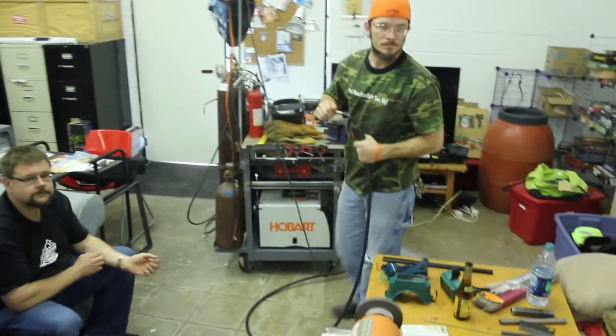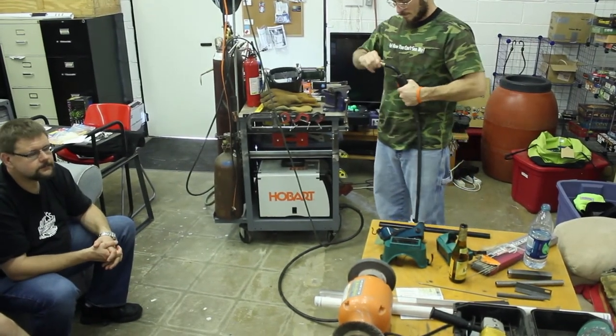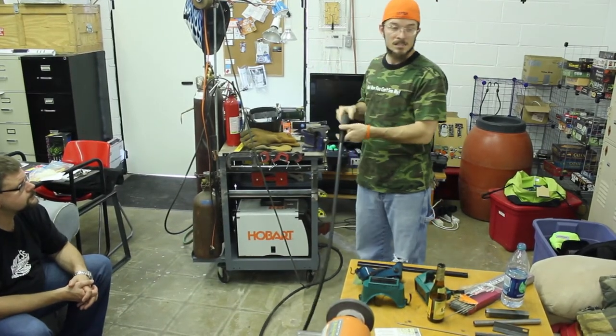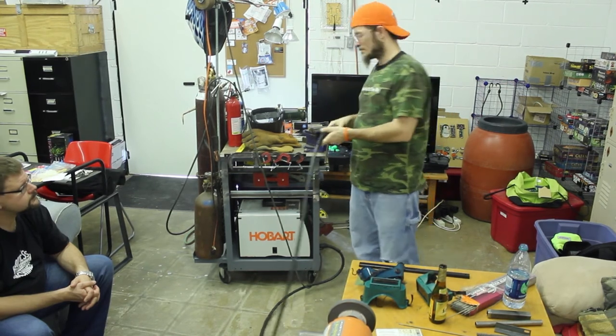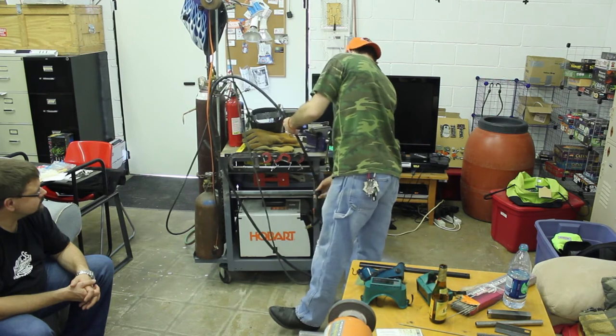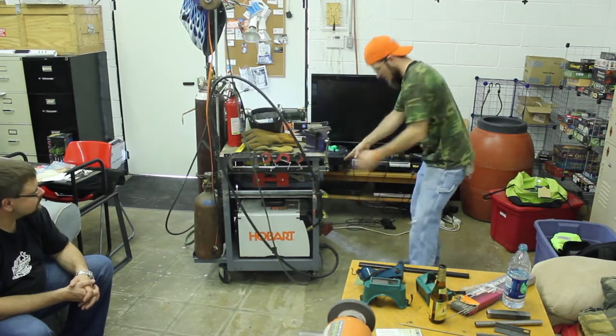Does the trigger control the flow of the filament, or is gas going out at a steady rate? Everything. It controls the gas, it controls electricity, and it controls the mechanical feed. Gotcha. So hold down if you want it hotter, more or less? Same temperature. What you do for that is adjust it on the front.